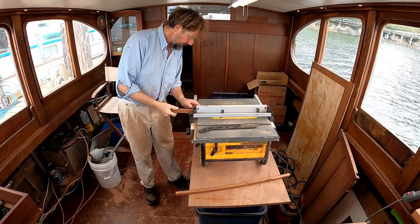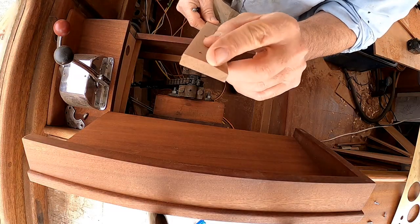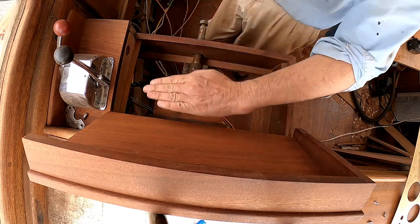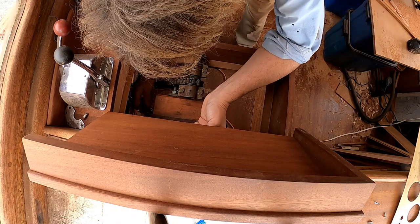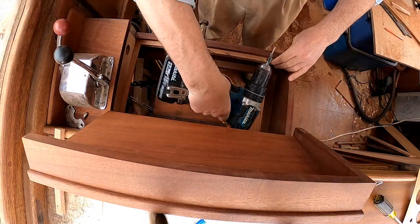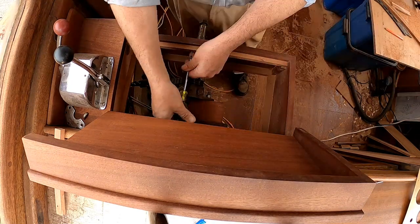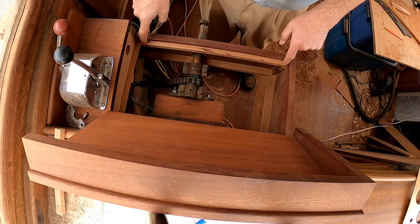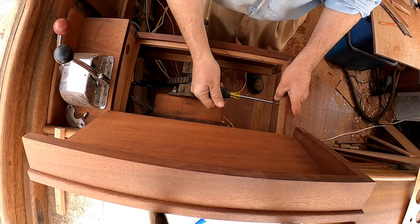For the ledger at the back I've cut the slightest five-degree chamfer on the backside because of course the panel is on a five-degree slope. You're not going to be able to see any of this but I'm going to be under here and attach it. This piece is also beveled at five degrees.